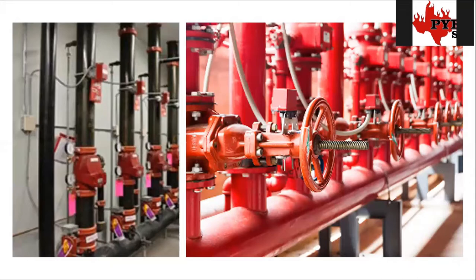Our fire alarm panel needs to let the building owner know when a valve is not open like it's supposed to be. You can see there's flexible conduit coming down to each tamper valve. This is a very large sprinkler system — probably for a warehouse — where they'll have a whole bunch of different sprinklers. Each one has a conduit whip coming down to it. In the picture on the left, at the bottom of each sprinkler there's a smaller valve with a 1900 box over it, and a conduit whip going up to a monitor module mounted on the wall, with another conduit whip going to a red box — that's the water flow switch.